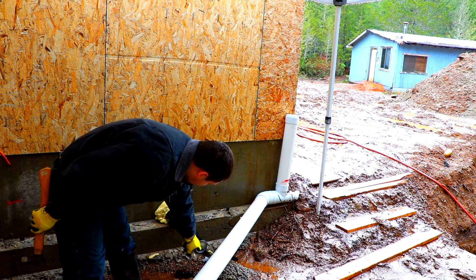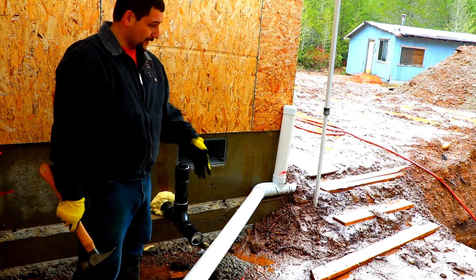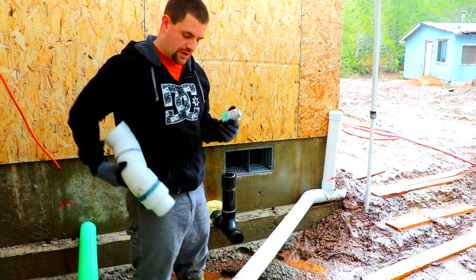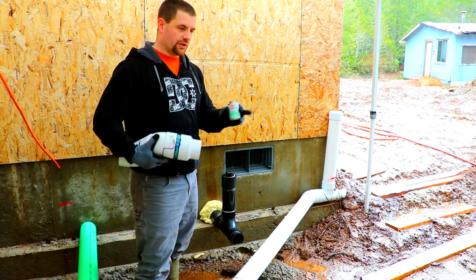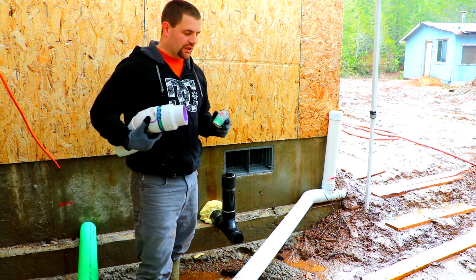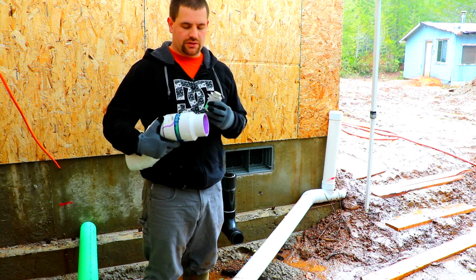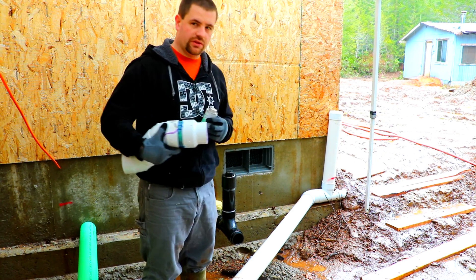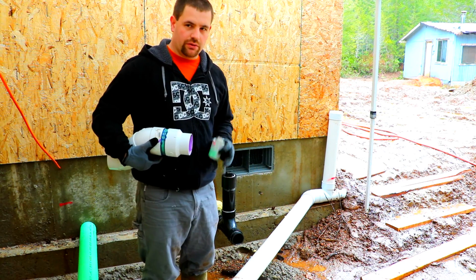This is that little clear cover — the heat broke it loose and we let the water out, which all went into the septic tank holes. Now we're going to put a PVC adapter of 3-inch to 4-inch to connect the septic line from the ABS that runs out of the house. We need specific cement glue that actually melts a little bit to make this adhere to the PVC, because with ABS you can't use regular cement.